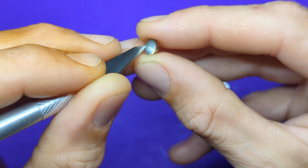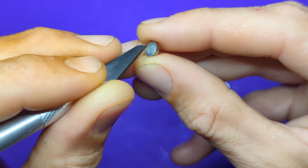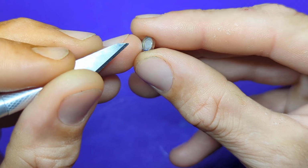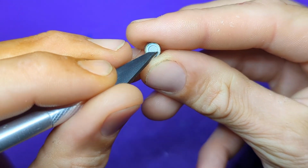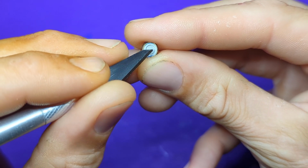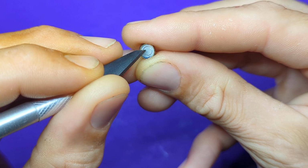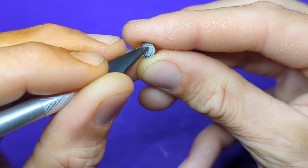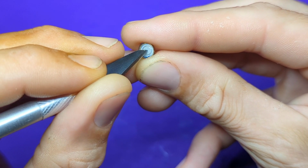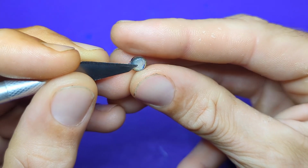That ferrous metal essentially completes the field or extends the field and makes the field bigger or stronger, has a greater area of effect. So anyway, having these two magnets so close together, I think could possibly have a diminished effect. But it also depends on the placement of the voice coil. There's a certain criticality where you need to have the voice coil to achieve maximum flux between the electromagnet and the two stationary or permanent magnets. So anyway, this is a magnet structure.